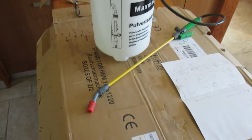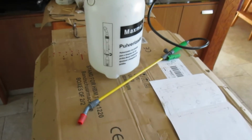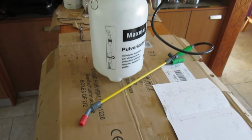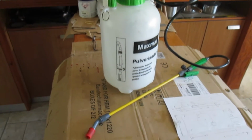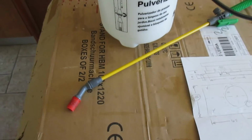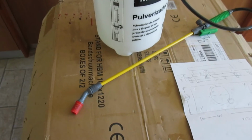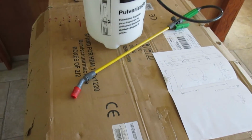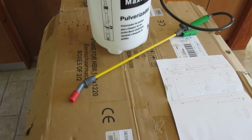Now for the downside. The machine came, and when I inspected the oil in the gearboxes, of course it's full of crap and iron dust. So there's some good videos on flushing out the headstock, but just for extra information, this is what I used: a garden spray with a long nozzle, because you can get it right down between the shafts, right to the bottom of the main gearbox, and sort of flush the debris out through the drain hole.